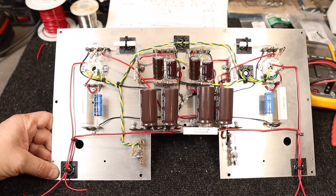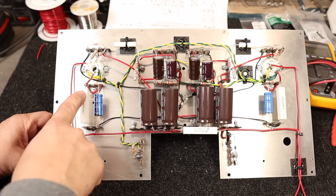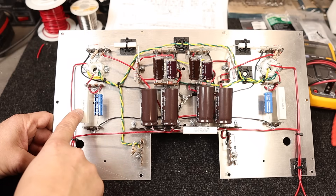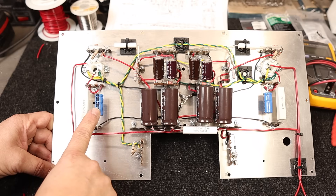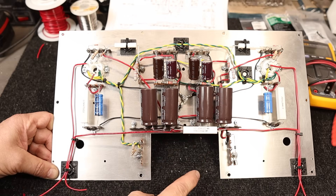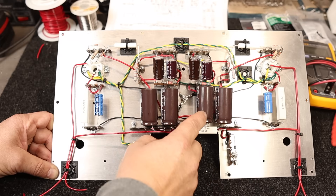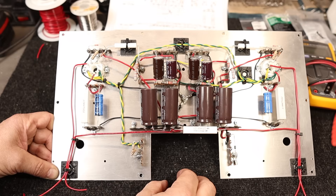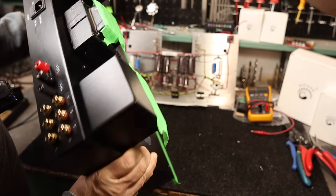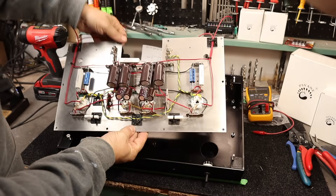The main board is all done — everything is mounted and it passes the resistance checks. The bias resistor of the 6L6s can get quite hot, so we want to make sure the bypass cap is kept at a distance to avoid degrading it and extend its life. The transformer here can produce very high B+, and filter caps rated for 500 volts or more are quite expensive, so I have two smaller ones in series. That helps handle the high B+ when you first turn the amplifier on. The chassis is all ready and I put some tape on to protect the finish.